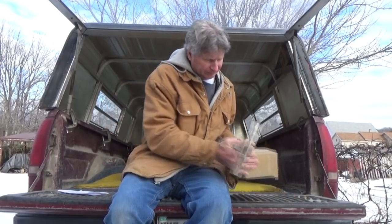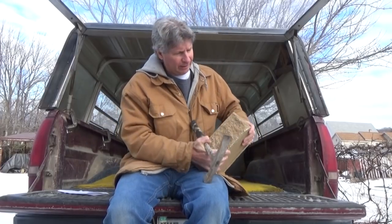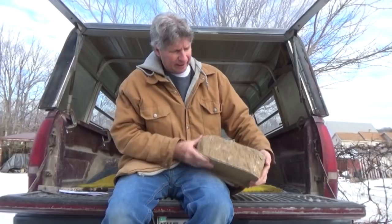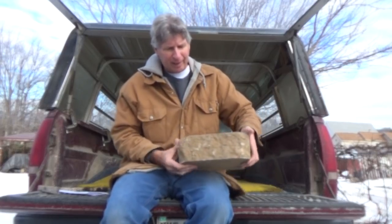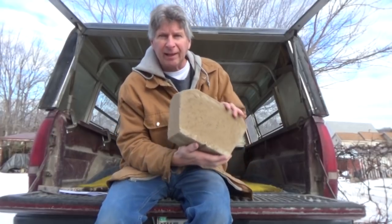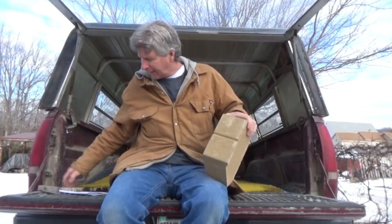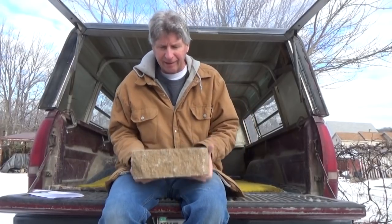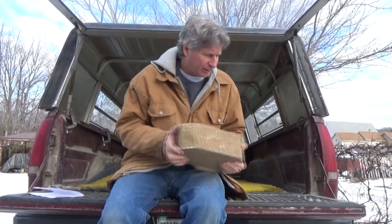If it was my house and I didn't have an issue with the rain gutters, I would have ripped everything out and put some big stones in there and been done with it. I don't consider it a retaining wall — I consider it a garden wall. It's only two feet tall. These are the kind of stones that went in there; they're man-made stones and you could actually get a hammer and make them look the way you want. They make these in two pieces, snap them in half, and you get a rough look. But these ain't going to hold back tons and tons of dirt — they're garden walls.